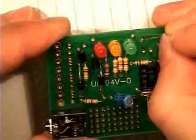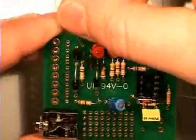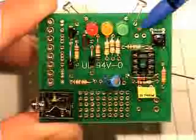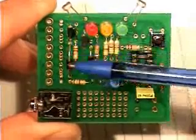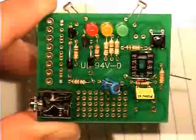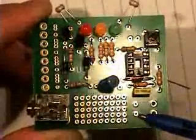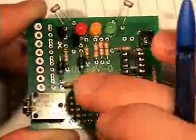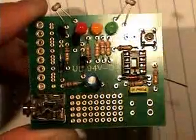Nearly finished — we've got the LDRs, the light-dependent resistors. What I like to do is have a little bit of lead space there, and bend them over so that they can track the light when we make the light-dependent robot. Just notice that there's two pins on the right hand side that aren't used, and all of these pins on the left are not used either. There's also a few pins there for the power cables that are going to be put through later. There's a prototyping area on the board that should be all clear, and there's also a single pin there available for the 5V output.